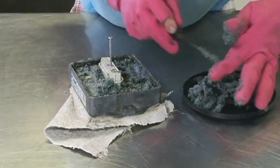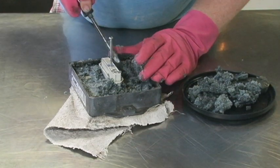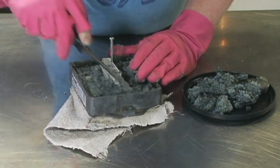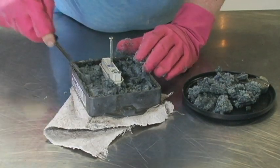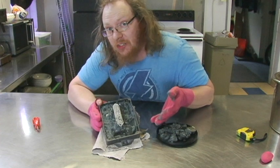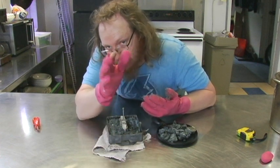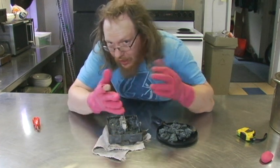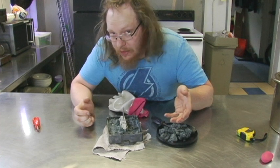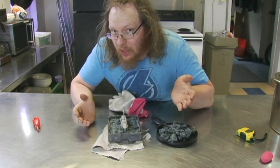I notice while it cools down, it's getting harder to work with, so we're going to have to boil it again. I'm considering that a success. At the very least, I now know exactly what CPU this thing is using. That turned out even better than I expected. I can actually just chisel away a little bit more, clean it up, and I'll be able to probably remove this board with a little bit more work. But as long as my finger is sticking out through my glove, it's a bit more difficult. So I've got to go buy myself another pair of gloves. You can keep in mind right now that when it comes to de-potting these using boiling water — sure, it does work. You will have to do a little bit of extra work and re-boil it to get the parts out, but as you can see, it's working absolutely beautifully.